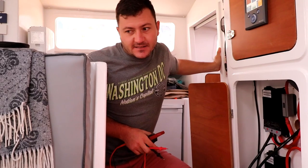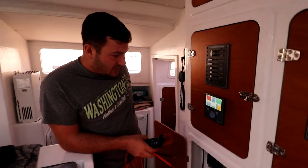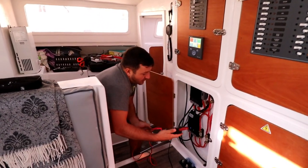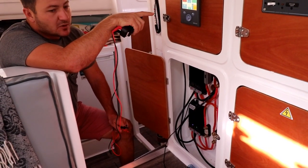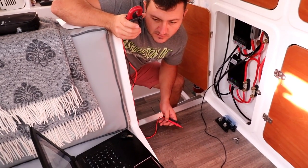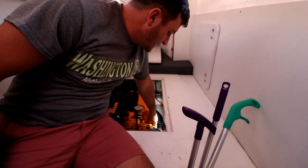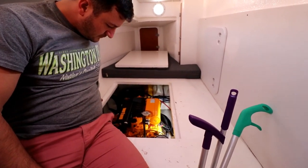Okay, 15 seconds. It's at idle. That, I'm very comfortable with. That's nice and safe. But what is it giving if it's going? 40 amps. Oh no, sorry, it's 35 amps it's giving us at the moment already. 28 amps. 28 amps is what we're putting in. It hasn't been running for long, but I can hold it with my hand. Crank up the RPM a little bit. So the one buck boost is working, and now we're going to test the other one.